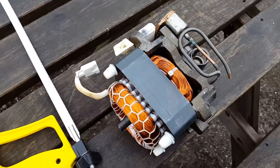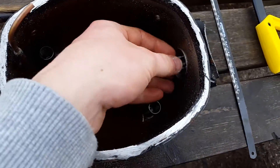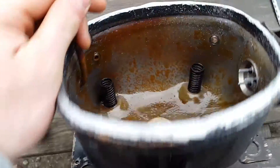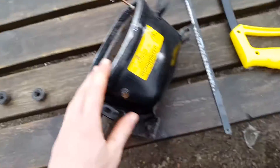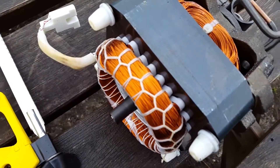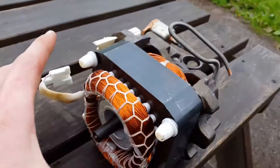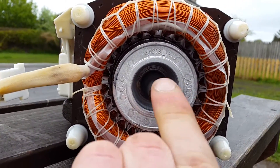I have never had a compressor come apart so easily — it literally just lifted out after cutting the discharge line obviously. And then the connector just pulled off. With it being open to the air it has corroded a little bit inside, because someone had left it before my friend got to the fridge and stolen all the copper off it. But here is the little motor in there — that is where it gets its lubrication from.